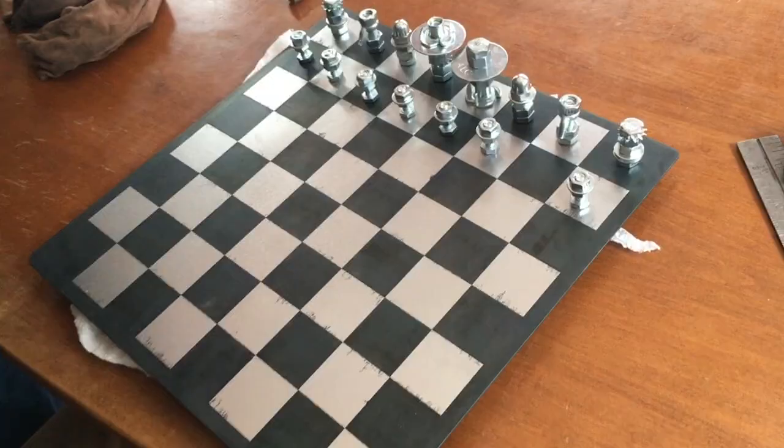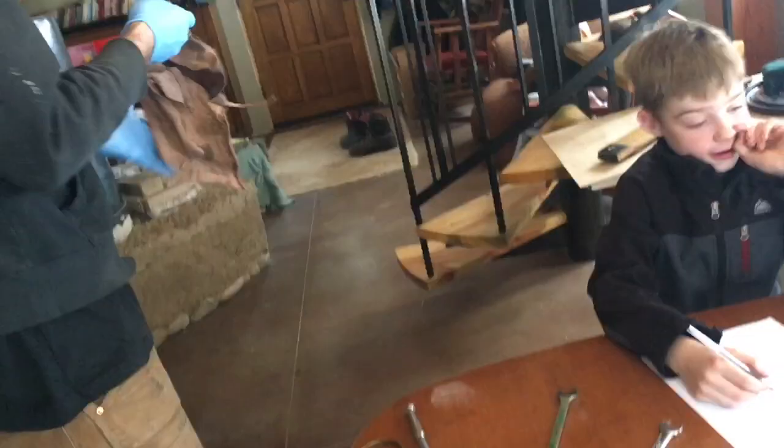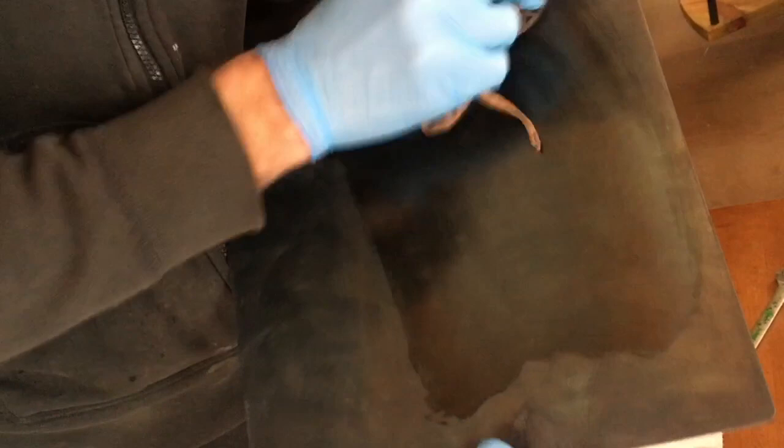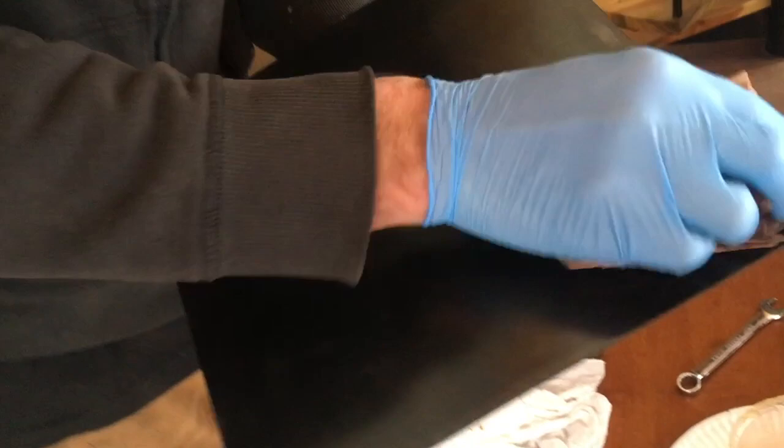I brought wrenches, Milo, so we could make all those super tight. So what is this stuff? This is boiled linseed oil, and it polymerizes as it cures, which creates a protective coating. It's not unlike what happens on your cast iron pans, and it protects it from the elements. So it's a great steel protectant. It keeps it from rusting, and it gives it a little richer color. It takes hardly any oil at all, so I even rag it back off, because if you leave a thick coat on there, it gets gummy. If you do thin coats, it'll actually harden.